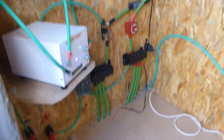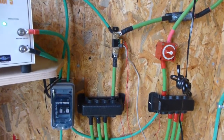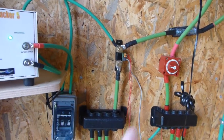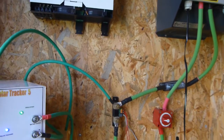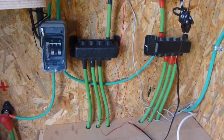I want to fix up this cable mess and make it look a little bit more professional. I'm going to lower my bus bars down, which will free up space, and put a breaker box in to hide the two bus bars. I also have to add another shutoff switch for the PIP and fuse the PIP as well, and get rid of this little breaker box. I'll also cover the terminals coming in from the solar and incorporate the upper breaker box into the center panel.